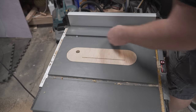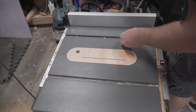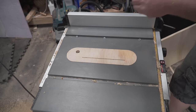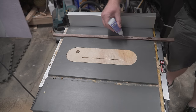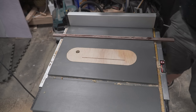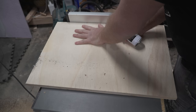You could probably make a couple of these so you can use them for angle cuts and dados as well. This next one may seem a little bit redundant to the crosscut sled, but this is actually a jointer sled or a rip sled. It's super versatile — not only is it able to joint lumber, but you could also throw in a reference fence and a couple of clamps and turn this into a tapering jig or even something you can use to cut segments for segmented bowl turning. These are super versatile sleds and super easy to make.